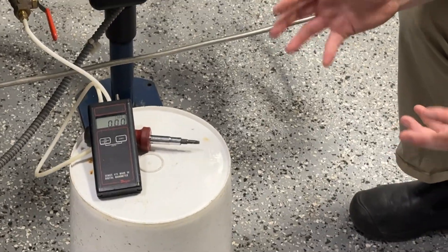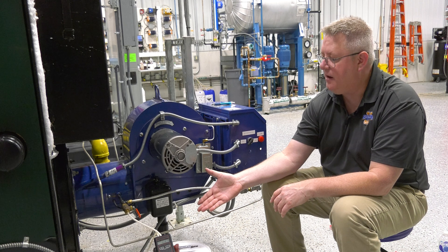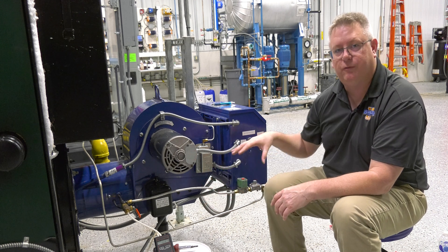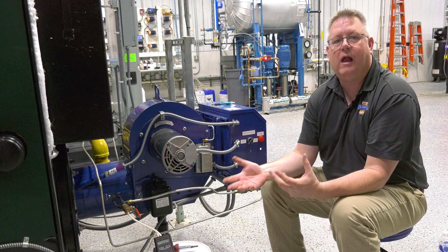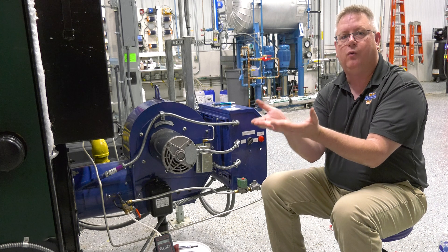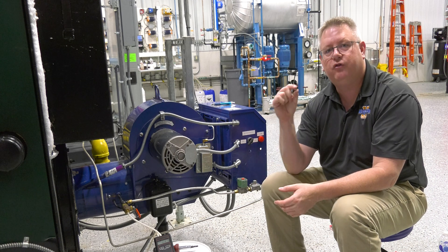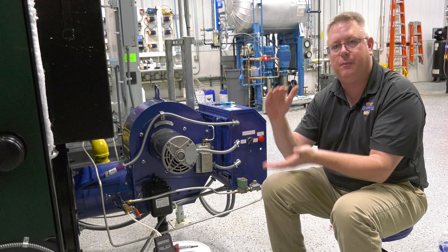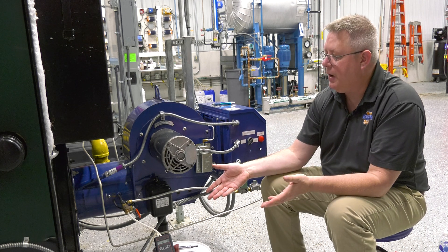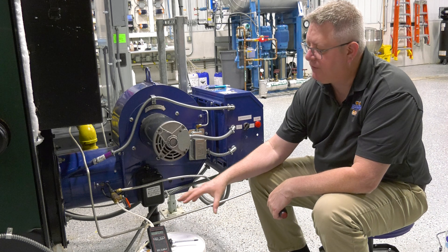We can verify pilot pressure with a manometer. When we get to the pilot ignition phase, I'm going to lock it in test and look at that pressure. I'll move the pilot regulator in and out to see what the spring range essentially is. Generally, if I've got a nuisance pilot, I will test it until I see where the high end is where I have problems, and I'll run it with very little gas until I see where I start to lose flame signal, then try to split that difference — because I feel that gives me the best margin for error on both sides.